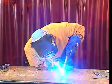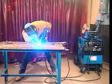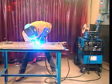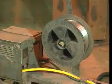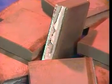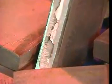In this part, we're going to cover gas metal arc welding. This method is also called metal inert gas welding, which is why you sometimes hear it referred to as MIG welding. MIG welding was developed in the 1940s to improve on two deficiencies of the TIG welding method that was developed several years earlier. With MIG welding, filler metal can be added at a fast rate, primarily because it is fed semi-automatically from a reel rather than manually. Also, at that time, MIG welding was better suited for welding metal thicker than 1/4 inch.